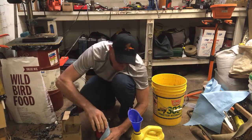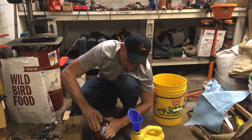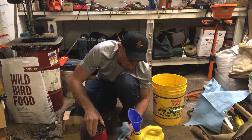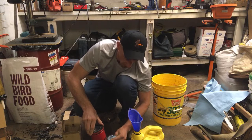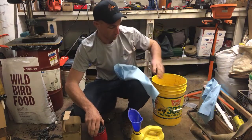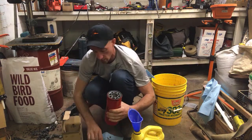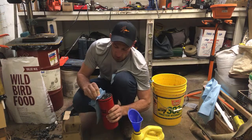There's a warning light on a 748 G2 — that's the skidder I'm running — and this warning light started coming on the other day. It says oil filter pressure, not sensor; that comes into play in a minute. It's telling me that the pressure is too high at the oil filter. Sometimes it used to do it when the machine was cold, when you first started it up, which is understandable because your oil is more viscous when cold and it's harder to force through the microns of the filter. It would do that until it got warm, which was fine. But then it started coming on all the time when I had the throttle all the way to the floor.